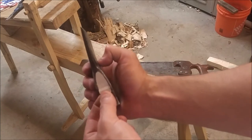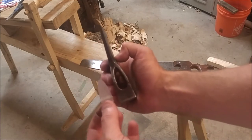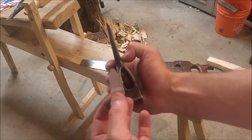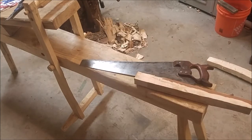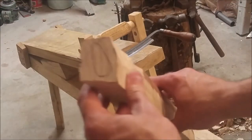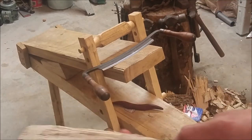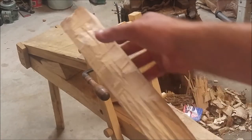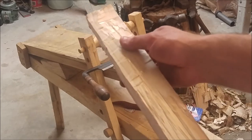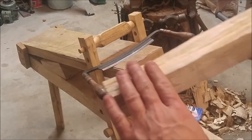Make it tight. After you draw your line, make sure you stay away from the line — even an eighth of an inch — until you get the level of dryness that we're looking for. We'll take it down with the draw knife on the shave horse most of the way, making sure that we leave a little bit of extra material in and around this area here. There's a bit of a flare — it helps to seat the head onto the hatchet handle.